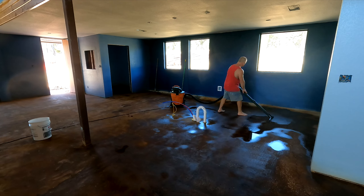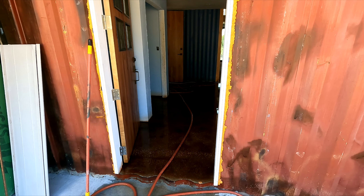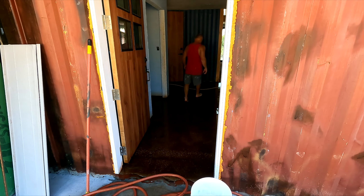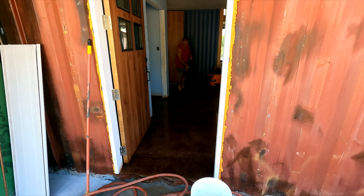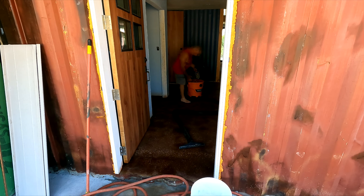We're almost getting there — here's the kitchen area. You'll notice the stain is not right up against the wall because there are cabinets, a stove, fridge, and an island going in there. I always do these last videos near the end of the process. The entryway is the last thing I have to do — spray a bunch of water in there, probably oversaturated with the baking soda, but hose some of it out and then vacuum the rest. We let it dry overnight before we can do any of the sealer. Thanks for watching the vacuum sessions — works pretty good, get one. Later, bye.